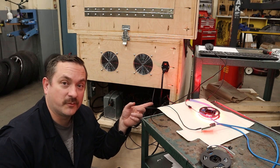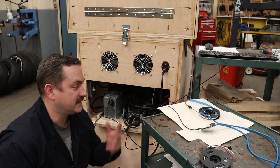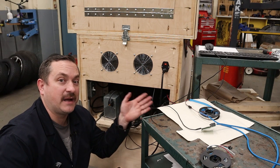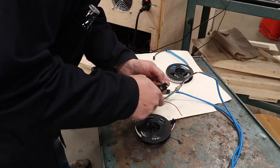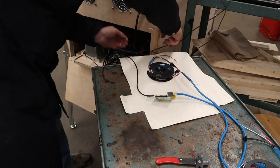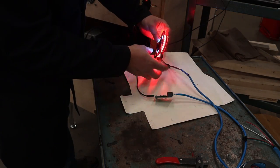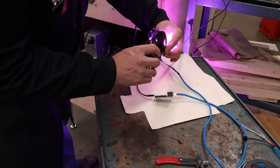I have to be careful here — there's enough amperage in that 5-volt power supply to be dangerous. So I'll hit my light switch to kill the 5-volt power, safely get in there, disconnect the wire nuts, hook up power to the other strip, and change over the RJ45 connector. For you at home, make sure you kill the power to your LED strips when switching over so you don't get hurt. Flip the switch — LED glory! Spend the time to unwrap it and make sure all the LEDs go all the way to the end. Perfect.